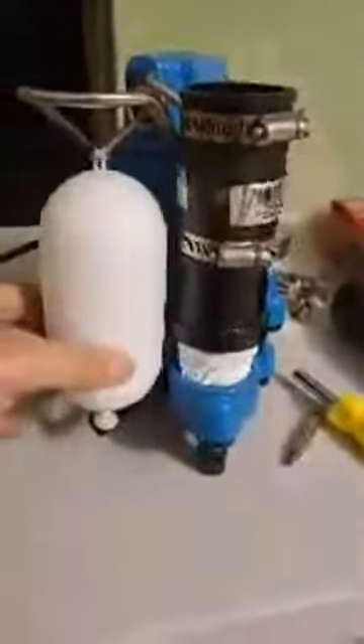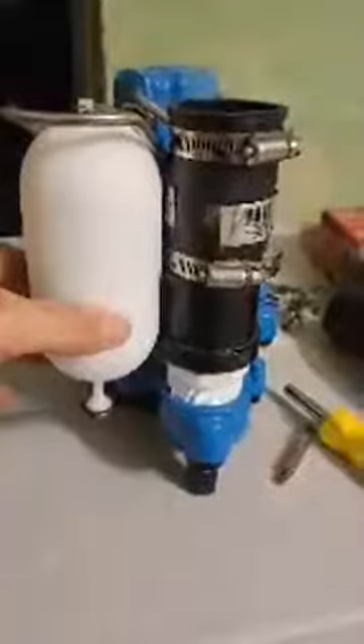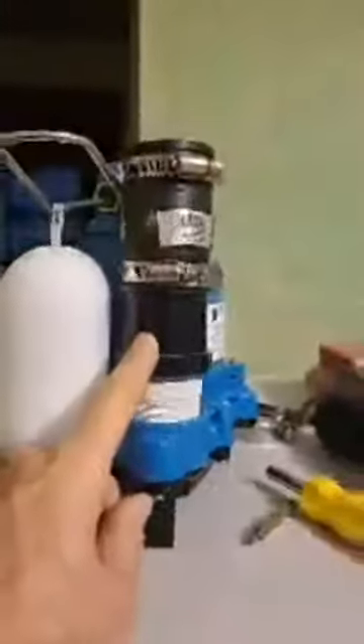Over here we got our insulation. Right here we have a check valve, and there's also a different version of the check valve. This black thing is the check valve; this thing right here is called a Fernco. I am not using the screwdriver bit — I am putting a 5/16th nut on this. When you tighten these things you don't have to fight trying to get that thing in that slot — quick tip right there. On these Goulds pumps, here's how they work: this float goes up as it fills with water, you hear that click, the switch goes on, and as the water pumps out it goes back down and shuts off. That check valve does not allow the water going up the pipe and out of the house to go back into our bucket.